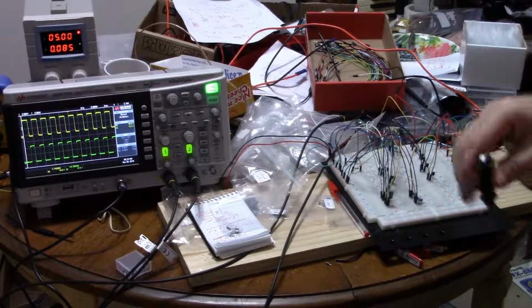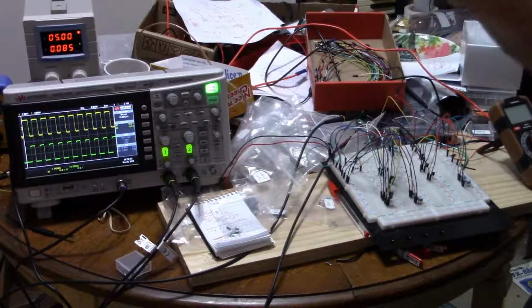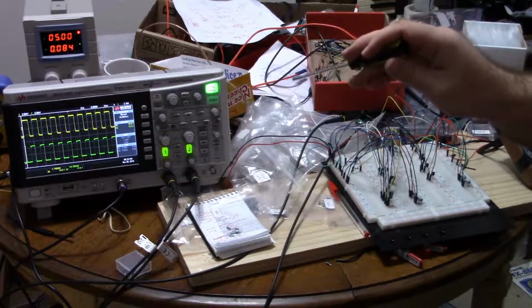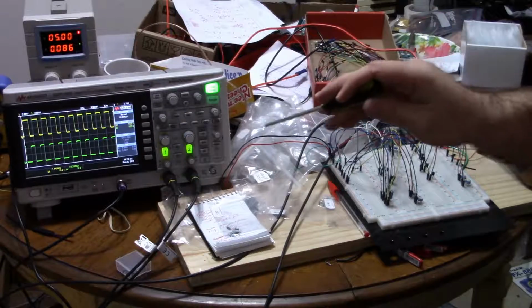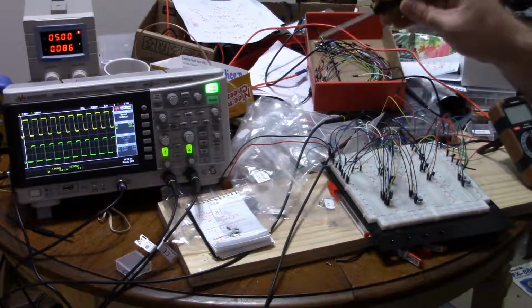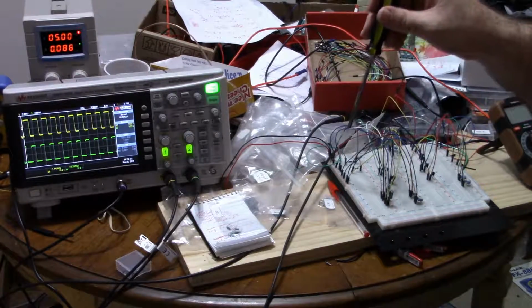So once again, with both of those resistors at zero, which should leave one path completely without any resistance besides the wires, I have a 100 milliamp limit right now, and it's drawing anywhere from 83 to 87 milliamps. It's not limiting, it's at the full 5 volts. So something about these transistors is naturally being limited, even though the base current is completely unlimited.